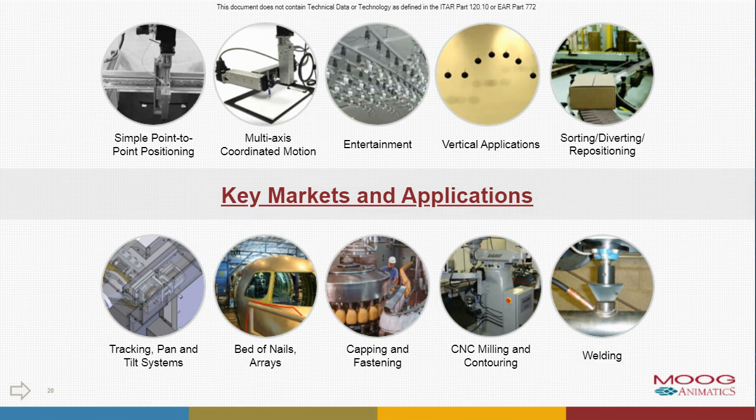There's also something called bed of nails or arrays. In this particular case, you can see that's part of a jet. When they're building the skin of the jet — the outer hull — they have to support that hull while they're water jet cutting through the outside for ports like windows or pitot tubes for airflow detection. This bed of nails actuator system is a whole slew of rod-type actuators that the smart motors are connected to, and it controls the form of that. Additionally, you can go in there and control aspects of the shape of the airfoil of a plane. We've even done these bed of nail actuators within wind tunnels.